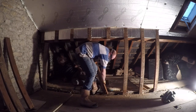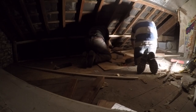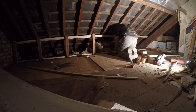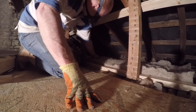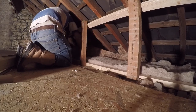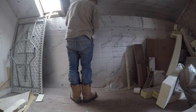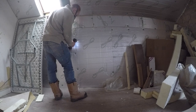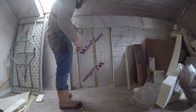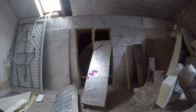We put a tiny little stud wall — we've gained 1.2 meters here by moving back into the eaves — putting a timber on the underside of the rafters and one down onto the joists, then using up some of that old timber for studs. I made sure we insulated that space, rolling out some mineral wool and spare sheep's wool to bring it up to around 300mm total over the top of the joists, because this was going to be a non-accessed space once blocked off. And this is the final one of the hatches into the loft areas — I had a bit of 50mm in the middle that could be removed, which enabled me to remove the two bits of 100mm between the studs and frame that one out as well.